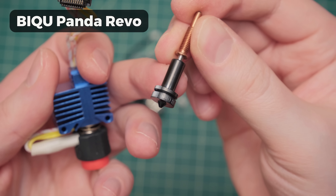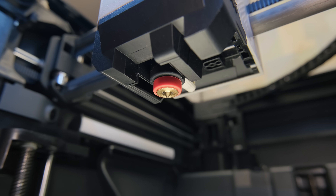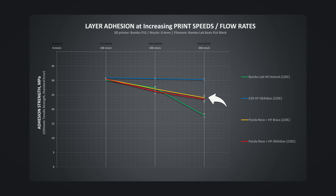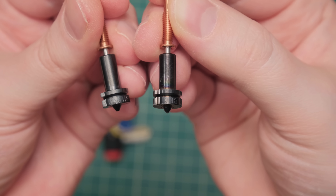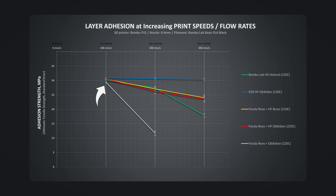However, the same flow-rate-increasing design on the Revo High Flow Obsidian nozzle leads to way worse results using the Panda Revo hotend. To be honest, I expected this, but not by this much. It only significantly outperforms the stock hotend at high printing speeds and flow rates, but still with quite a high decrease in layer adhesion strength of 23%. To make things worse, the Panda Revo comes with a high flow brass nozzle by default. Not only does it not offer a significant boost in melting performance, but having a non-abrasion-resistant nozzle on a printer that constantly rubs and probes the tip of a nozzle is probably the worst combination you can have. I also tested the regular flow Revo Obsidian nozzle just to see how much performance we were losing without that CHT-type insert — and it is like day and night. Regular flow Revo is good only up to 7mm³/s flow rate, though with only two data points the adhesion curve would look somewhat different in reality.